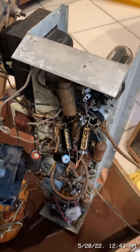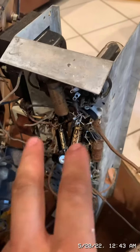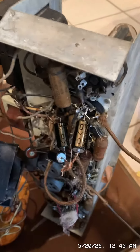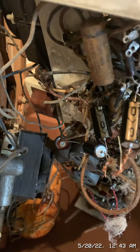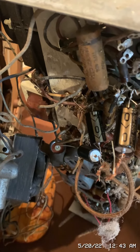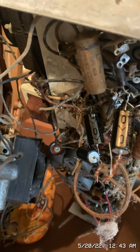I have replaced two out of the three canned capacitors with these axial capacitors. This one's value is 10 microfarads. And that one's value was two 15 microfarad capacitors, which I replaced with 16 microfarad capacitors. I have 15 microfarad capacitors on the way, but I still haven't replaced the final, or third canned capacitor.